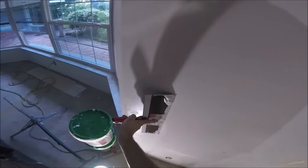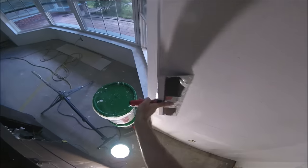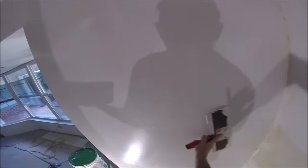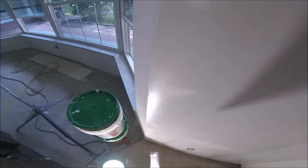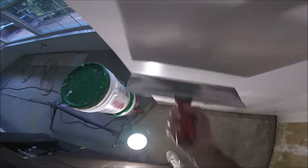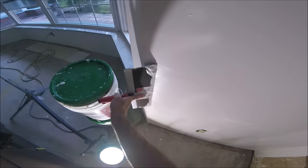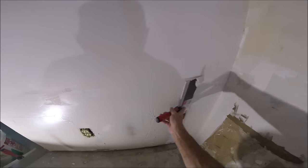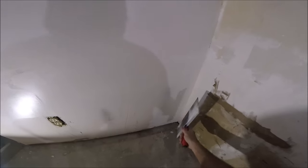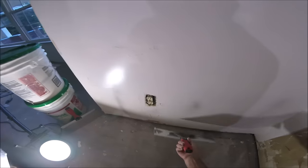I'm putting pressure on the right side and lifting a little on the left, which gets rid of those knife marks. I am applying a little bit of pressure just to squeeze out any air bubbles and keep it nice and slick smooth. Let me know in the comments if you have a wallpaper removal job you're working on, and also let me know if you're a DIYer, painter, handyman, or contractor. Here's a pro tip: always have good lighting, even if that means getting some LEDs or work lights. The more you light up the skim coat, you're going to see all the imperfections and be able to make it nice and tight, which makes sanding so much easier.